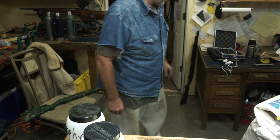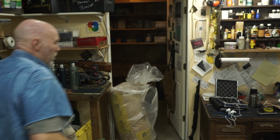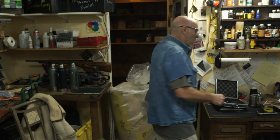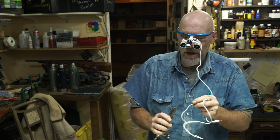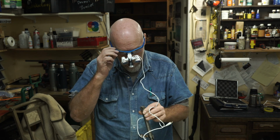The only other project I've got going right now, this is kind of funny, kind of cool. I got a couple of minutes here. I'll show you. Remember the Teslong? Everybody needs a Teslong? Well, everybody needs one of these too. Your dentist uses one. You must have it. Right now, I've got an old 721 here, useless to me. 30-06 bolt face, well it was a 30-06 or a 270 or something. But with this right here, I can eyeball down into here and I can grind out the little pegs that keep the extractor from rolling.